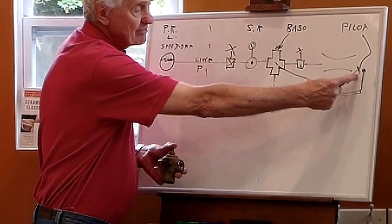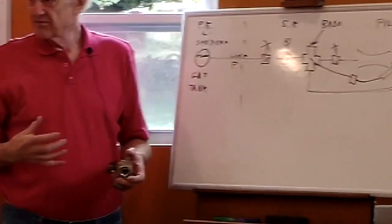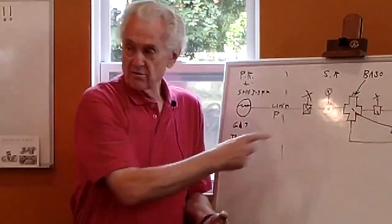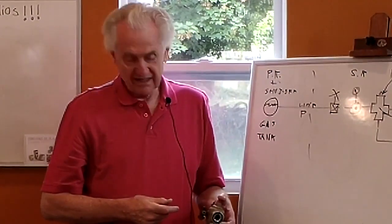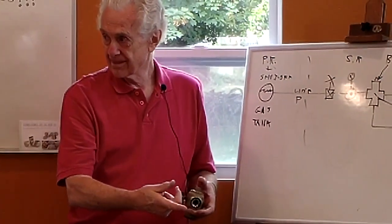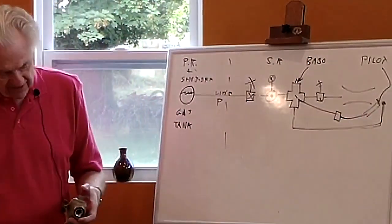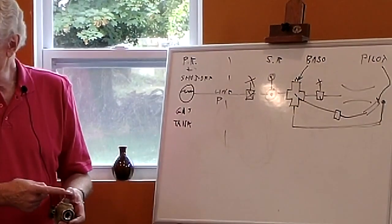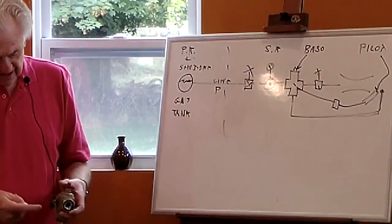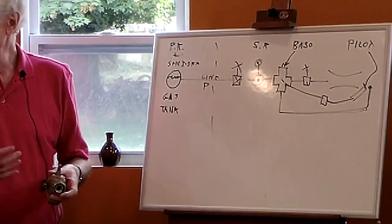And then the thermocouple detects the heat. And if it's hot, it says, okay, my pilot light is going. Now I can let the gas through the main pipe. So it automatically lets the gas through to come to the main burner then. Okay, and once the pilot is lit and the thermocouple is measuring it, I can let go of this button. I don't have to hold the button down anymore, and I can let go slowly, and the pilot stays lit because the thermocouple is telling it, okay, it's hot, I can keep the valve open.